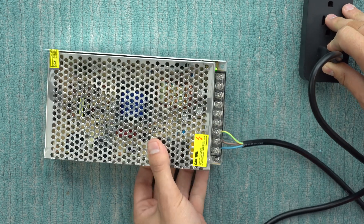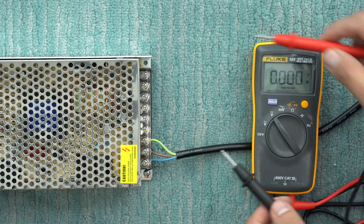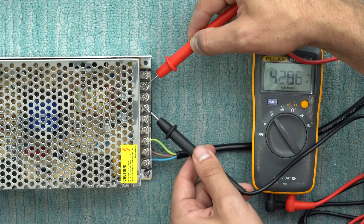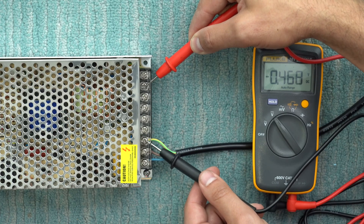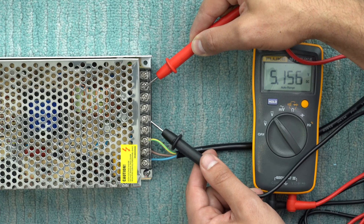Awesome — that's a good sign. We've got a power light on the power supply. Probing around, I'm curious to see if I'm getting five or ten volts DC from the DC connectors. It looks like this is five volts — so that's good to see. Hooking up to the common ground gives me zero volts, so I guess that's just for the AC. I am getting my five volts, not exactly five but I can tune that a little bit — that is how we're going to hook things up.